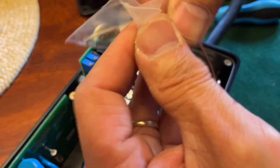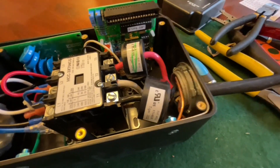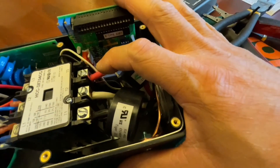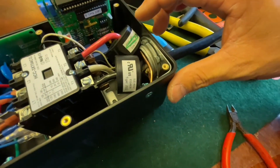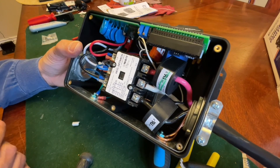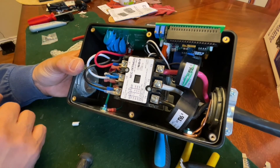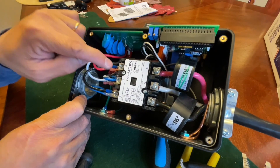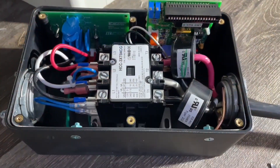Let's connect the ground. All right, let's go to the rig and get this mounted. The input will go right here — I'm going to pull those wires out of the distribution center and feed them right here. Same thing: red wire goes to L3, neutral goes to L2, and black wire goes to L1, leg one.